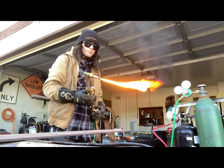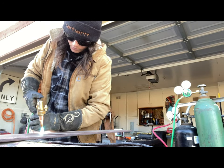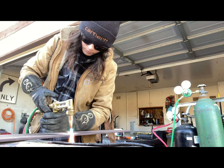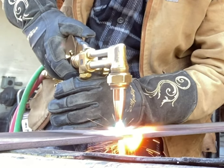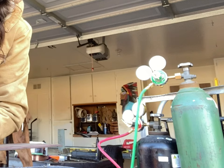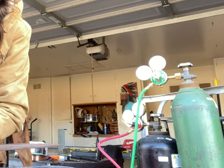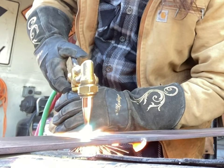We're going to open up our flame — oxygen valve, pull the trigger a little bit. There you go. We're going to warm it up because it's pretty cold. You can see the heat coming off of it. The oxygen and acetylene tanks are faced with the regulators away from me — about three feet behind me. You want to not have these regulators faced towards you, because the pressure in these can pop off those things if you're not looking out for yourself. You want to be an eighth of an inch away.